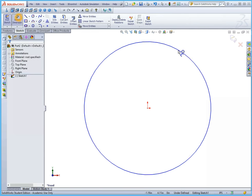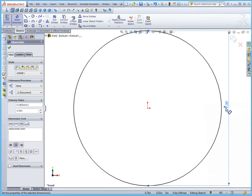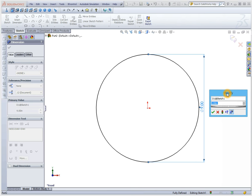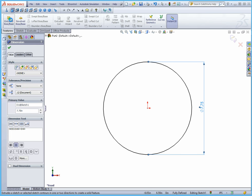If we were to draw the pitch diameter, it would be 9 inches — that's a good place to start. But we're going to make it a little bit smaller to draw the dedendum circle. To make this the correct size, we need to derate it slightly using the formula of 1.25 divided by the diametric pitch. So 1.25 divided by 2 is 0.625 — that's the amount the radius changes. To account for the diameter, we subtract off 2 times that. And there is our dedendum circle.